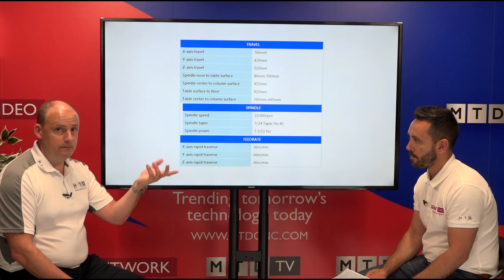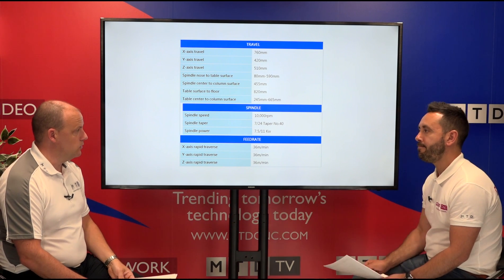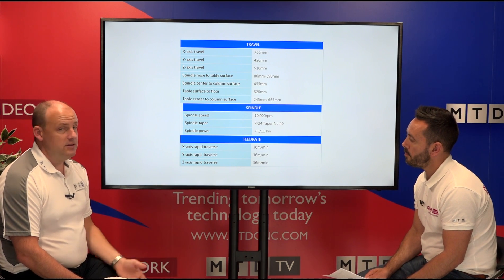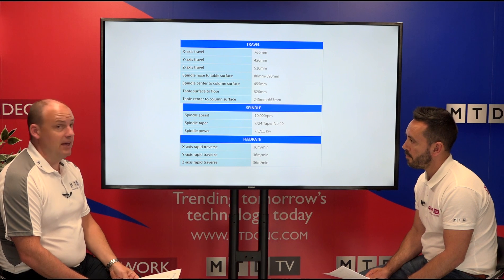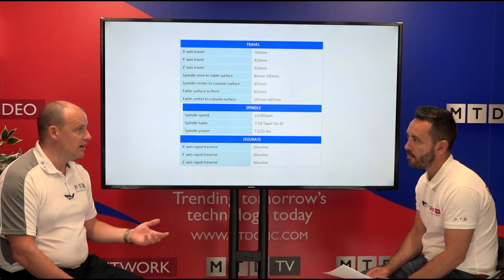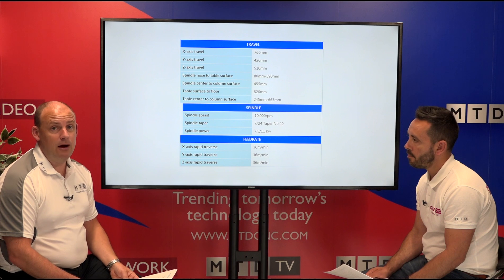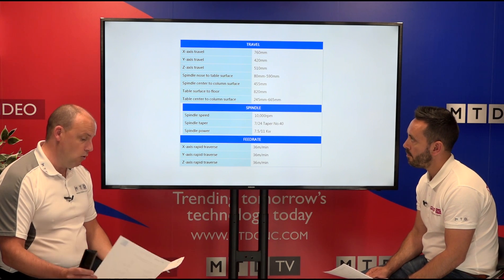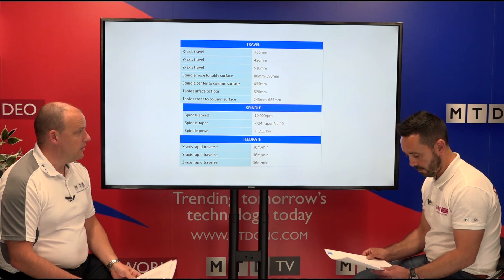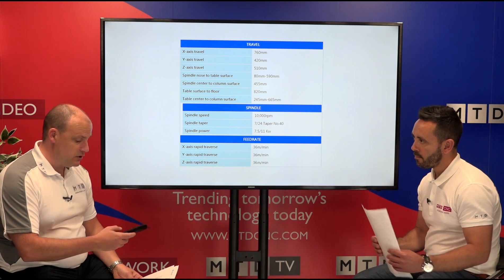On the face of it, it looks like a pretty powerful, fast spindle. There are 24 tool stations with a twin-arm tool changer, so you can have one tool picked up during machining — very quick tool change. Coupled with that, you've got 36 metres per minute in the rapids. Generally that looks like a pretty healthy speed and performance. The Fanuc control is obviously a popular control and that's what this machine is equipped with.